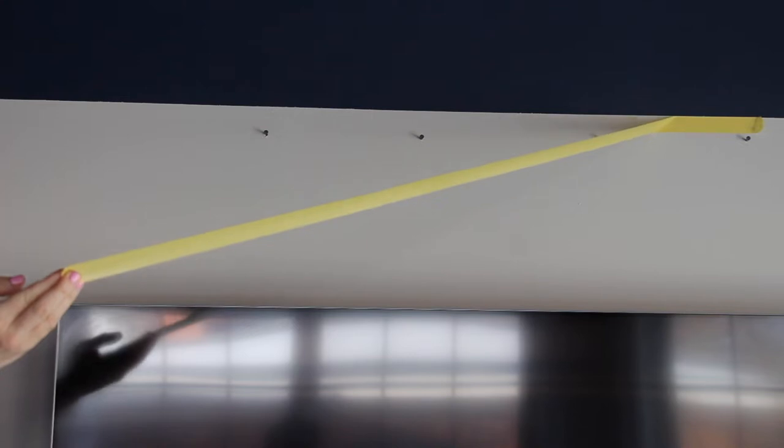To start this entire project, we used a laser level to create a line, then used frog tape to map out where that line would go around the entire playroom. Once that was done, we covered the entire floor so that my husband could paint everything from the frog tape line all the way to the ceiling. My trick is to create one long line using frog tape and then rip it off really slowly but kind of far away.